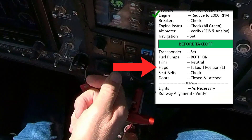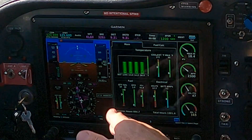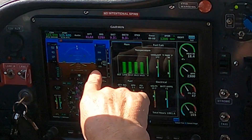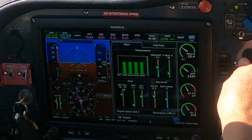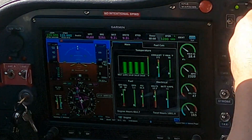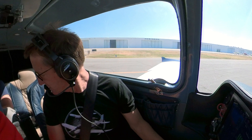You don't want to go much lower than 2,000 RPM because then you get a bit of chatter in the gearbox, which isn't good for the gearbox or the prop. A little bit higher is good. Then flaps to one, and both fuel pumps are on. I check all gauges — I go through: all green, all green, all green. We know if there was a prop issue that light would come on, but I always check they're all green. Then I check harnesses, hatches, and any heavy objects.